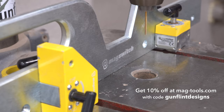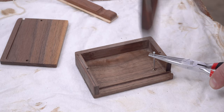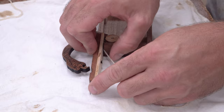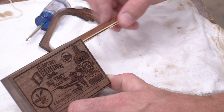I added nicer little spacers to either side of the pivot point, then tied a square knot around the base of the snake. I put a dab of glue in the pre-marked pivot location, then tapped in a nail before hitting it with accelerator, clipped off the top, and added the snake. The length of the string controls the timing of the snake — I found it was easiest to pull the snake all the way out until it kissed the slider, then push the slider back until it touched the base of the snake. At that point I wrapped the string around a screw, tightened it down, and snipped off the excess. I attached the back panel with brass screws because brass is classy, and then the snake in the box was ready to come out and play.